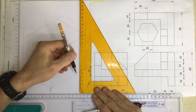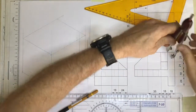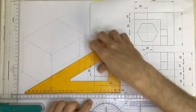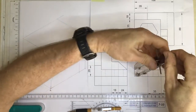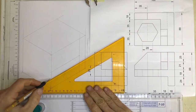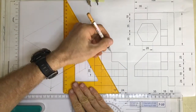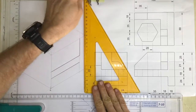I'm going to draw a construction line going up first. It says I need to come down by 25 plus 21, so I measure that off and come up to that point, drawing a line going across. I need that 18 again — this piece here is 18. I measure off 18, come over here, measure that off, and draw a line coming across there. That part is a corner that goes all the way up to the top, so I draw that up to the top on both sides.